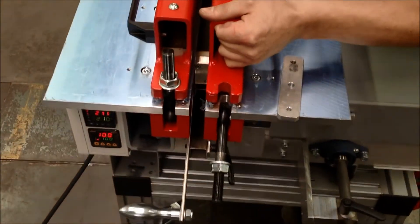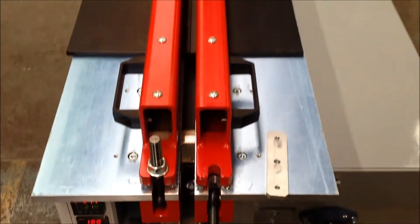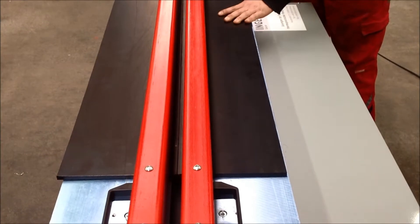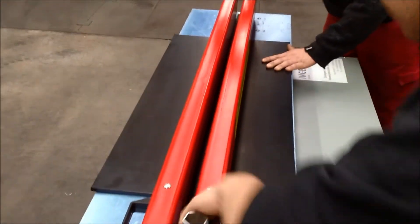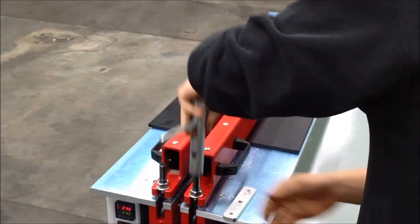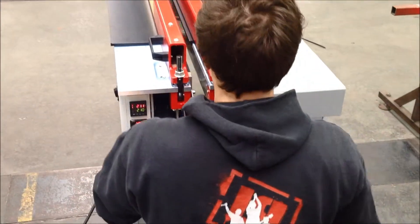The gap is now 20 millimeters — we have added another 10 millimeters to the initial gap. The right plate sheet is now clamped correctly against the left sheet, and you do the same correct clamping on the right-hand bar. Make sure it's parallel, and then after that, the welding starts.